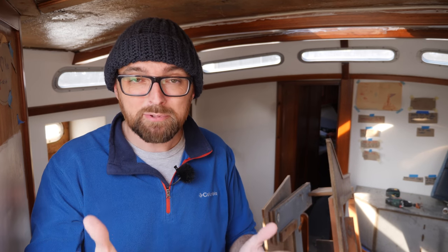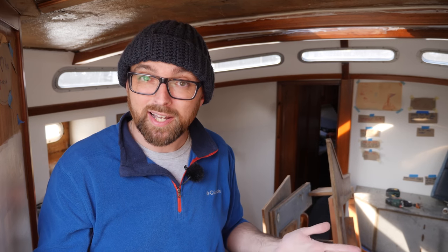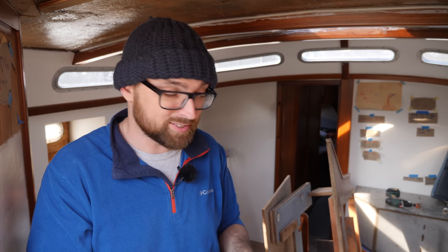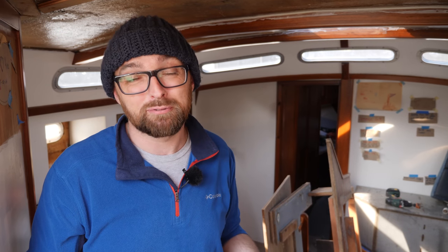I'm still waiting to hear back from the second structural engineer, but that's okay because I'm also waiting for the weather to get a tiny bit warmer. I'm sure some of you are going to be uneasy about the fact that I'm leaving the wet plywood in place, but honestly I don't think it matters — not even the tiniest bit. Let's say the plywood has been wet for 20 out of Athena's 30 years. There was no additional concentration of osmosis blisters around the structural members and no visible difference in the laminate at all. So I think that's going to be perfectly fine.